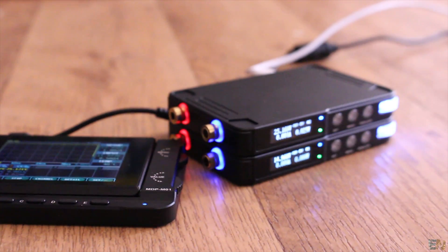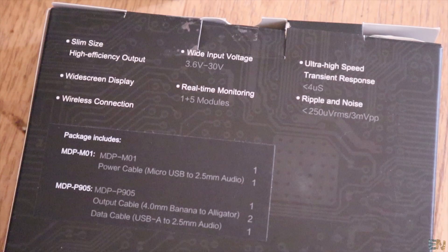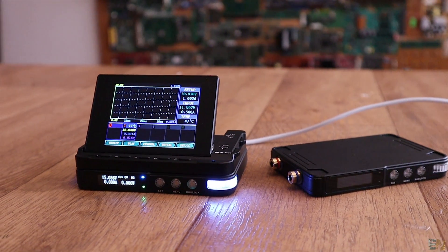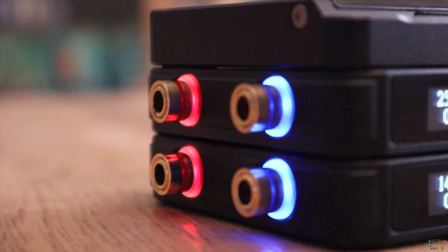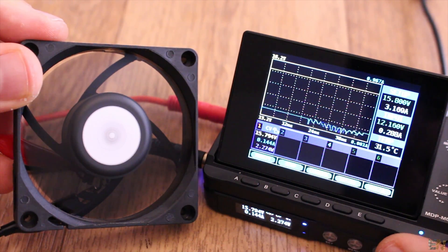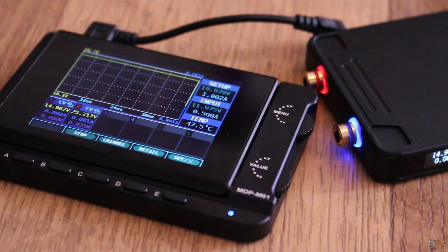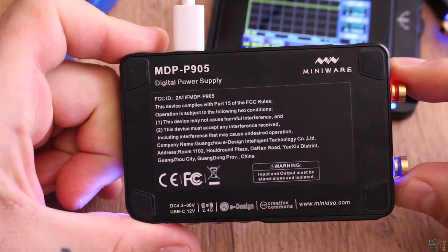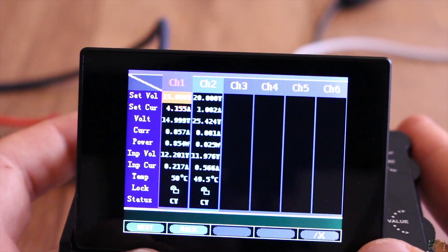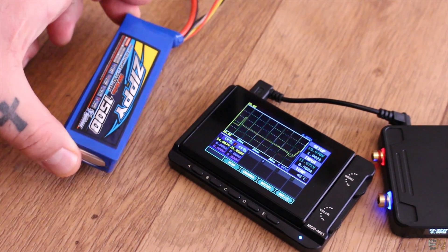I hope you liked it and got a general idea about this product. It has multiple supply support, is very easy to use, has a medium power output up to 90W — that's up to 30V with a 3A output. It has a TFT screen monitor, matching control with up to 6 supplies using wireless radio connections, high-speed transient response, and overcurrent protection as fast as 4 microseconds. It specifies streaming load regulation and intelligent line-loss compensation. Another cool thing is parallel current sharing for multiple supplies, free combination of collaborative load, and intelligent power allocation. It has input over-voltage, under-voltage, anti-reverse, output anti-backflow, and over-temperature protection. A maximum storage of 7MB, max recording time of 24 hours, USB firmware upgrade, and it can also be portable if you power the input from a LiPo battery.